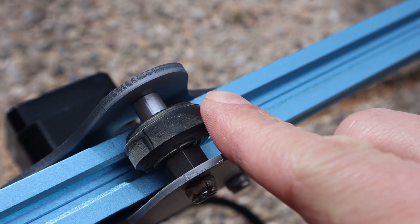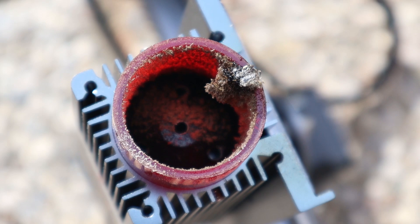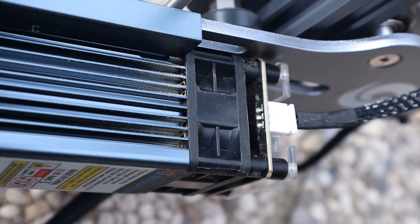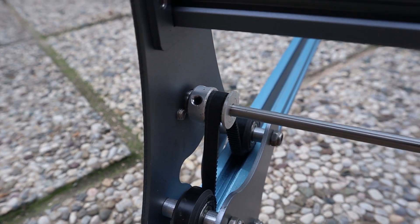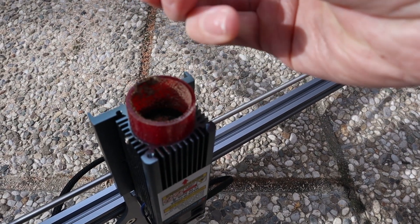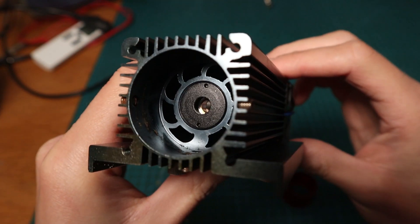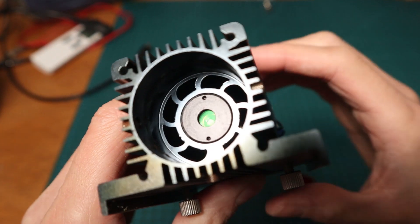Here is an aftermath of this colossal engraving. There is no wear on the rollers — they are just a little dirty. The laser head was expected to get dirty because I engraved a spruce board which has a lot of tree sap inside. Some dust got into the fan, but nothing too severe. Belts are still properly tensioned and show no wear. The lens had a small foggy spot in the middle — I cleaned it with isopropyl alcohol and a cotton swab and the lens was as good as new.